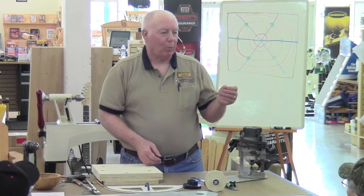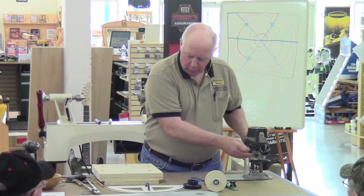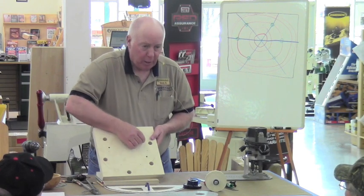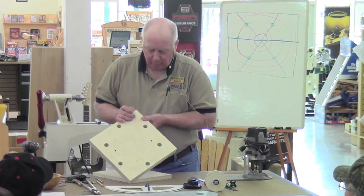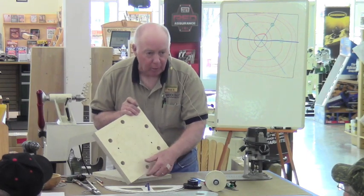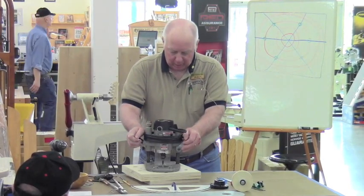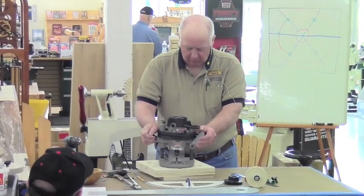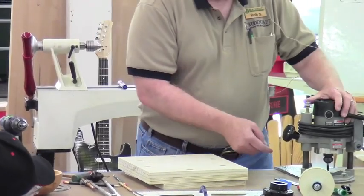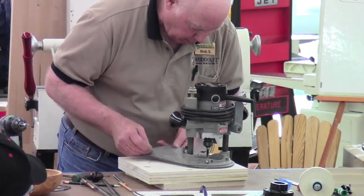If you lose this, as I have before, just use an 1/8 inch drill bit, because these are 1/8 inch holes in there. So what I'm going to do, you can see here the pivot holes. These are already drilled out to 1/8 of an inch. So I know that I have to pivot here and cut this arc. Pivot here and cut this arc. Follow me? So what I do is I take this almost down to the surface. Now I could measure all this stuff. It's 6 3/16 of an inch and all that, and use the guide. I choose not to do that. I find an arc, get this close, and then find the accompanying hole.